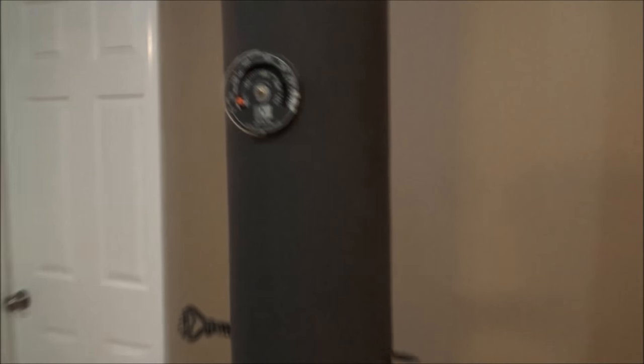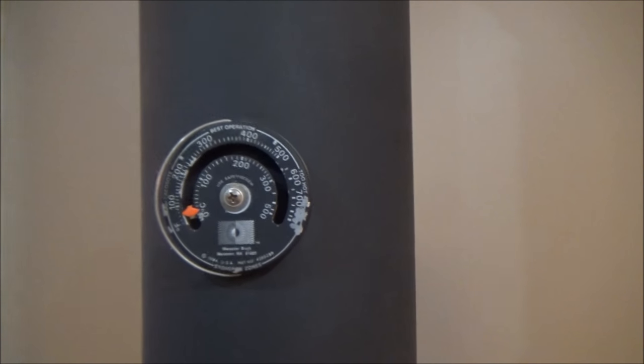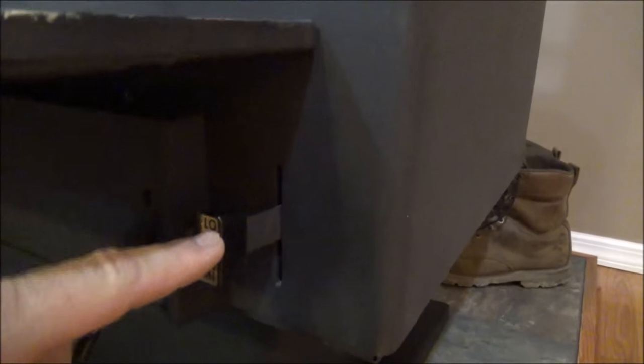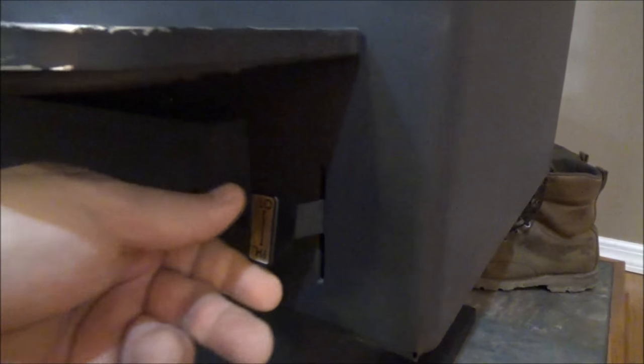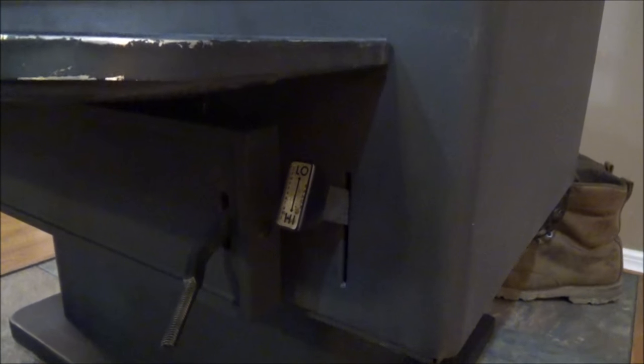Another thing about the stove: if you're going to be burning a wood burner, you need one of these — it's a thermostat for your stack. When you're down here burning your stove and adjusting these levers to go high or low, that thermostat up there responds to what you're doing. That's how you control your temperature. Once you get used to your stove you'll know exactly where to set it — like when I go to bed, I want it right there. I want to make sure this one is shut off, so having that gasket is a good thing.